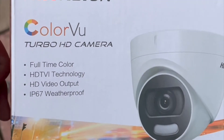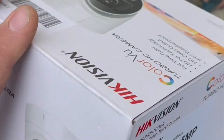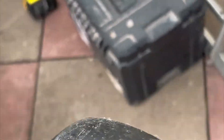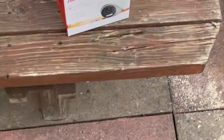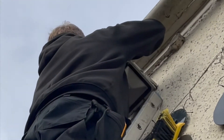The cameras we're fitting today are the Hikvision ColorVu in black — five megapixels, retrofitting into the old system. They're analog with a 2.8mm lens, giving a nice wide angle. Compared to the old cameras on the floor here — this is what we're taking out, a 720p low-res camera with night vision that wasn't very good, as you can see it's seen better days — the new ones are a massive improvement. One thing I don't like about these analog ones compared to IP is that the camera bodies are made of plastic rather than metal, but retrofitting the old system is a good way to bring it back up to date.